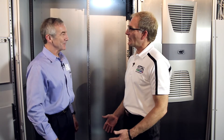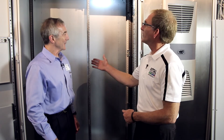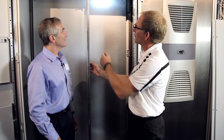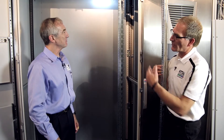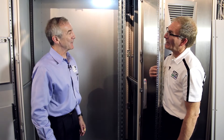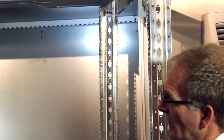We've been talking about industrial cabinets that typically have industrial controls in them. But increasingly in industrial settings you find electronic instruments that sit in 19-inch racks. There's a way to accommodate those even in an industrial control cabinet. That's one of the benefits of a modular frame-based system — it allows you to create multiple layers or levels within that same cabinet. One example is Ethernet on the plant floor. We have a full-height swing frame here — you can also get them in partial sizes — and it allows you to mount your 19-inch rack-mount equipment and then swing it out of the way to access connectors or wires on the back. This is approximately a 42U swing frame, so 42 components that are 1.75 inches in height — quite a number.